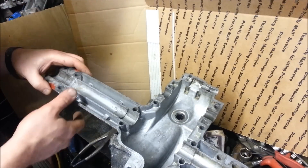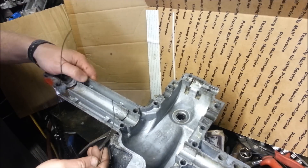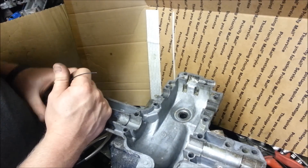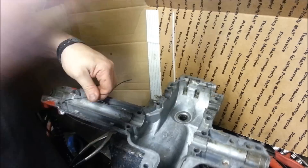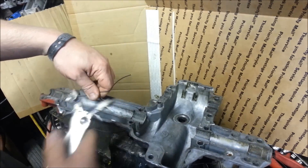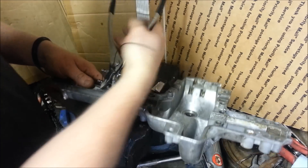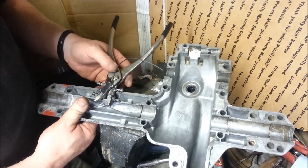I have my broken piece ground. I need to hold it in place, and what I'm going to use is just some bailing wire. There happen to be some holes that'll line up pretty good. I'll put those through and pull it nice and tight with my wire binding tool. This will cinch it on here super tight exactly where it broke, and we'll lock it in there. That's on there nice and tight, so it'll get a nice good repair.